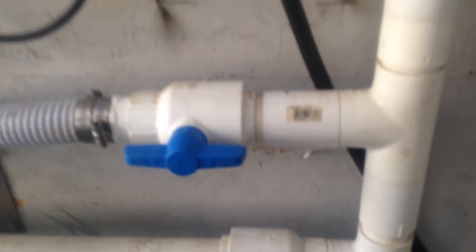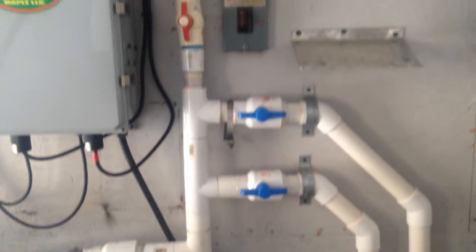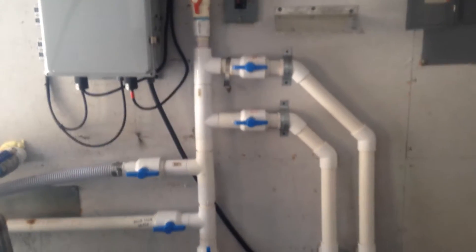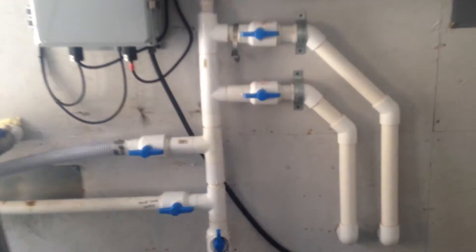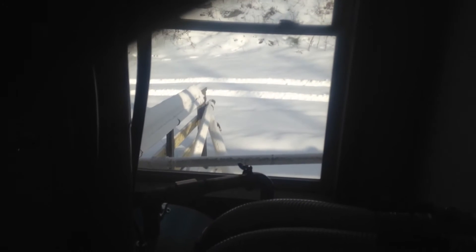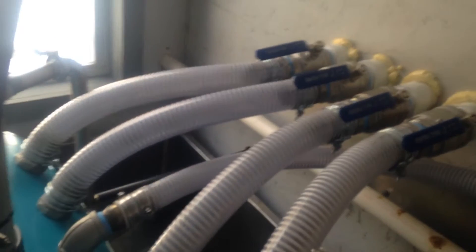Inside you can see a wash ball — a stainless steel wash ball. There's a ball inside that stainless steel housing with a bunch of little holes and slits cut in it. When we're here, that valve — hooked to this block of pipes and valves — connects to a pump in our permeate tank. You can turn that on and the different valves segregate where flow goes: either to a sap tank, the releaser, or this pipe here for truck tank wash outside.